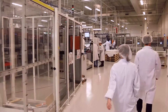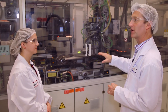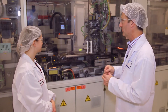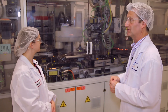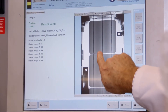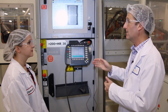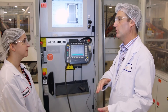After we make sure every solar cell going into a string is of equal quality, we need to make sure all those cells are connected together. Using a high-quality ribbon is critical — it's like using a high-quality electrical cable. The higher quality materials you use, the better life and efficiency you'll achieve. After putting the cells into a string, we analyze the string to ensure the ribbon and all connections are at equal distance with proper precision between cells and ribbons. If a string doesn't meet SilFab's quality variances, we reject it and either rework or discard it.